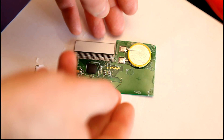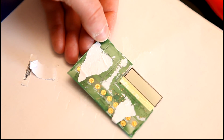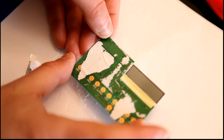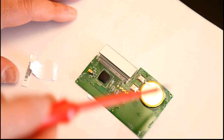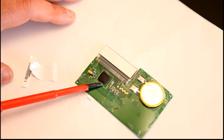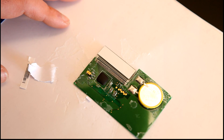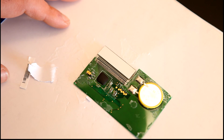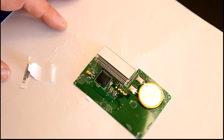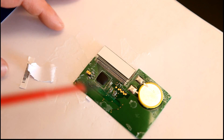We've managed to get it out — it was incredibly tightly glued down. Something's obviously happened: it's really unhappy now because it's flashing 88888, so it's obviously raised some sort of error condition as I was trying to force it out. On the back there's not really much to see — the battery, and presumably some sort of application-specific IC, a timing crystal, and just a couple of little decoupling capacitors. That is literally it. There are six decoupling capacitors — one of which I snapped off during the removal process — and two crystal stabilising capacitors, the battery, and the LCD.